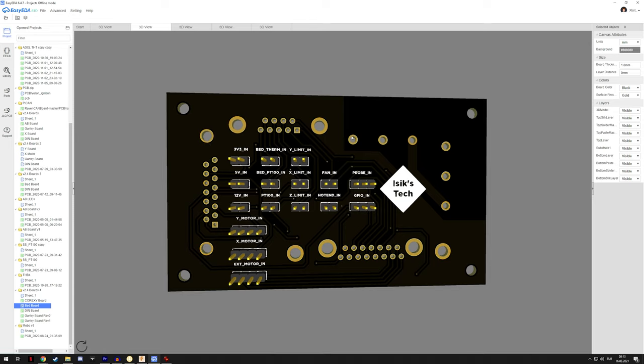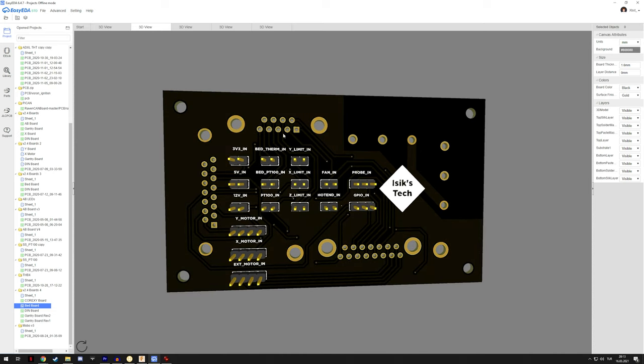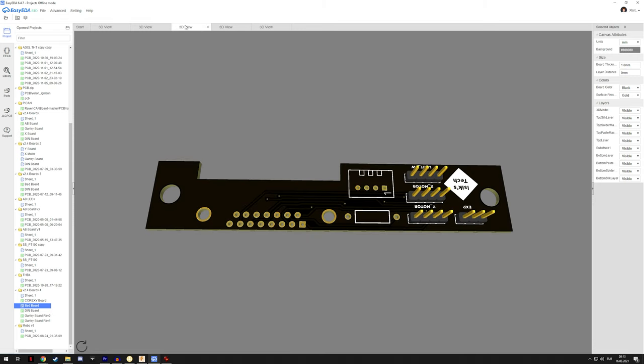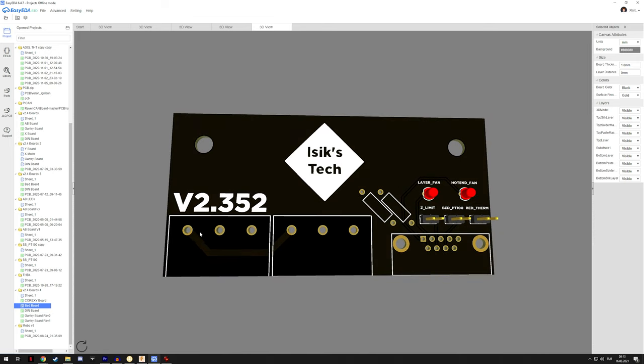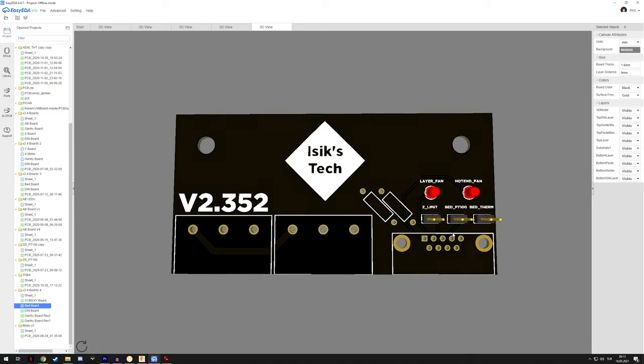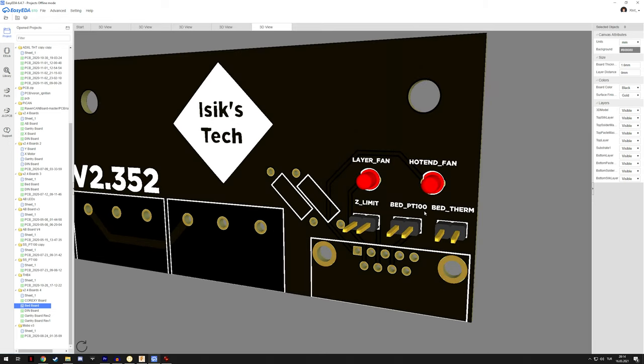The DB9 is that serial-looking cable — the 17W2 is a bit different but from the outside they look similar. I used those cables to wire up to three boards. For example, the bed board behind the bed has the bed power connectors, mains AC stuff, thermistor inputs, and I also had a PT100 input I never used — I removed that from the new board. There are also the Z limit switch and two LEDs for the layer fan and hotend fan, so you can see if they're getting power — useful for diagnosing if a fan died versus a firmware issue.